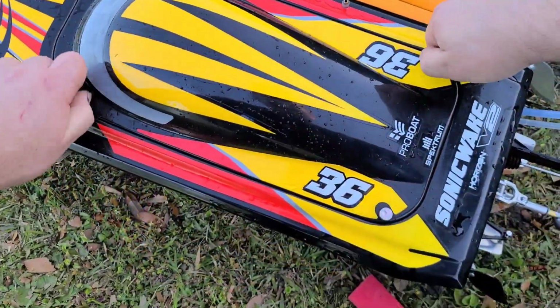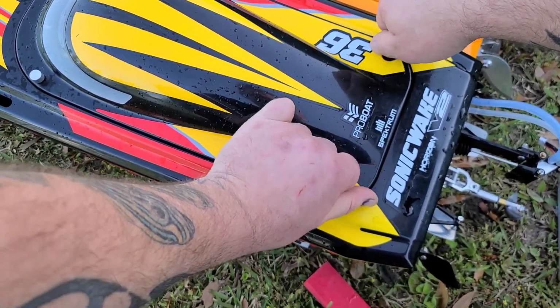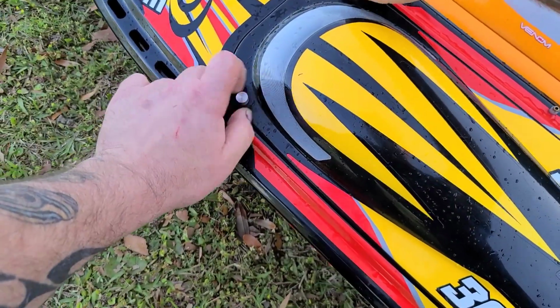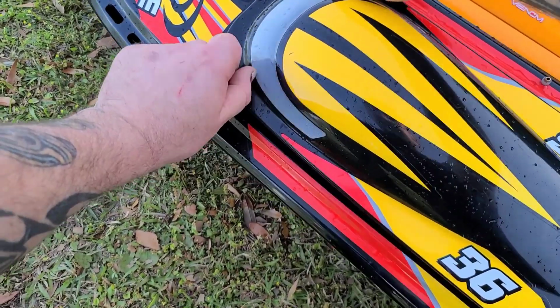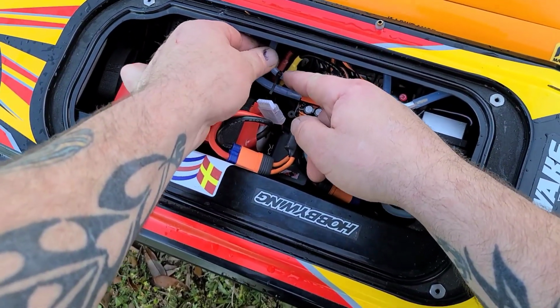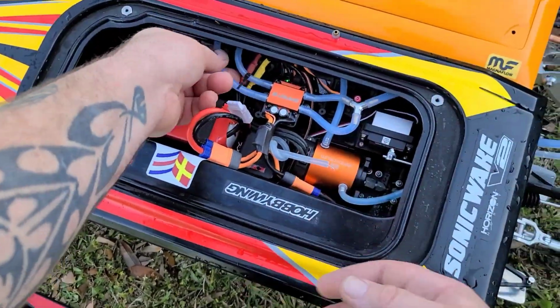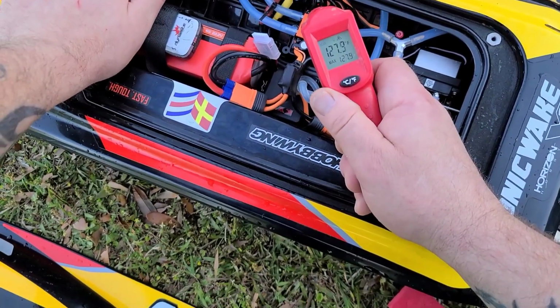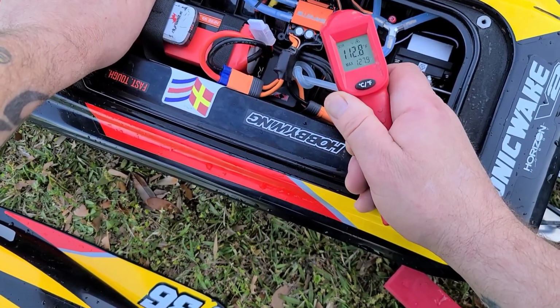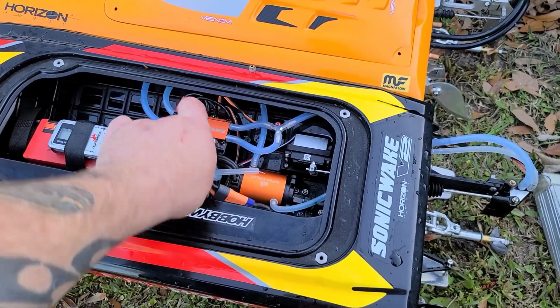And the temps were in the 140s here. So let's see if we can do any better. I choked off that cooling tube just a hair more to kind of even up the resistance on the flow. A couple of my subscribers said that water will of course take the path of least resistance. So what I do is I'm choking off this tube, the shortest tube, so that it will basically give it the same flow. All right, let's check the temp. 127, 126, 146. So yeah, these wires are hot.